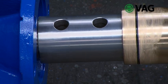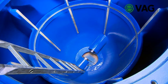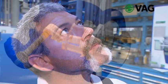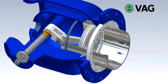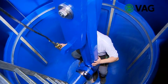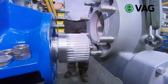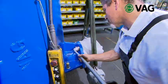The driven shaft for the operation of the plunger is made of stainless steel in all nominal diameters and runs in maintenance-free bronze bushings. This ensures a long service life as well as excellent maintenance friendliness. The lengthwise motion of the plunger is effected via a crank drive. The driven shaft runs on two bearings in the body. O-ring seals on both sides prevent water from leaking to the outside and dirt from penetrating to the inside. Via a self-locking worm gear, the motive power is transmitted to the inside on the crank drive by the valve shaft.